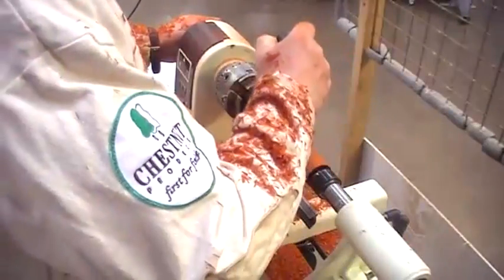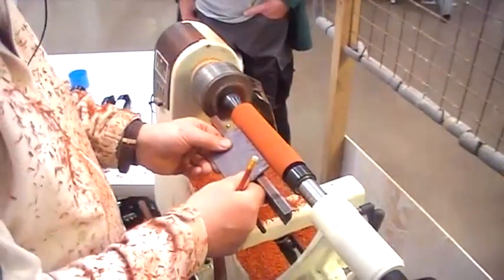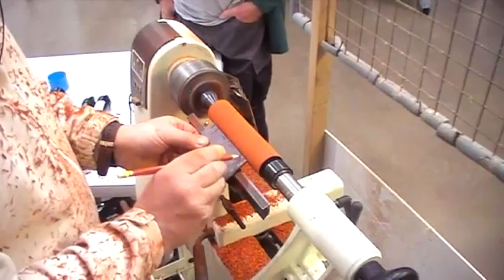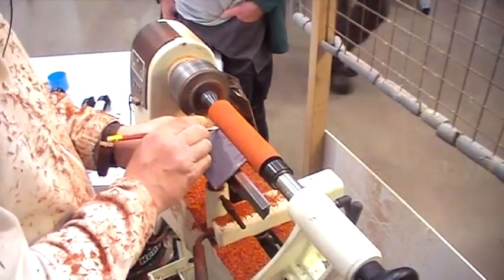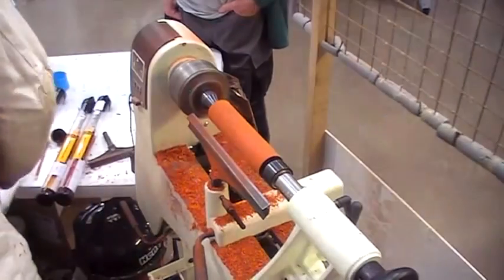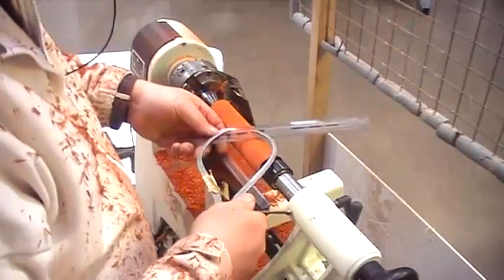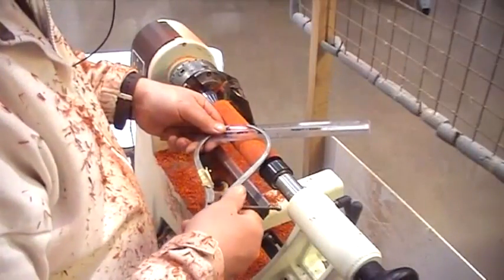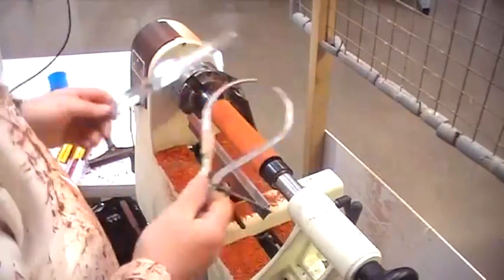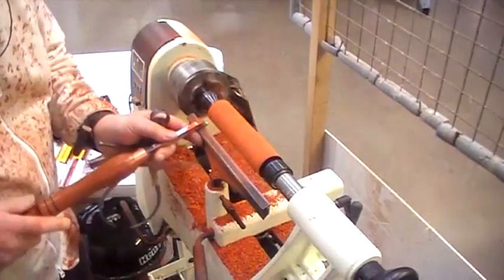I want to show the spine on the middle. With the template, I'm just going to put some marks on there — a mark there and a mark there for the length. That's where the bead's going to be, and that's where the bead's going to be, and there's the centre. Then I need to set the caliper to 25mm. What I like to do is put the caliper on the 100mm mark and set it up to 25mm from there — it's easier to see. Then I can use this tool again to remove quite a lot of the waste.